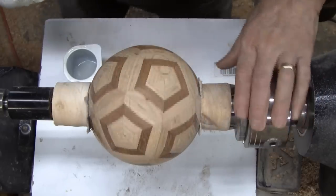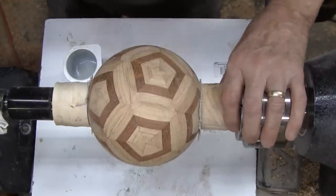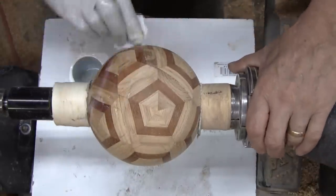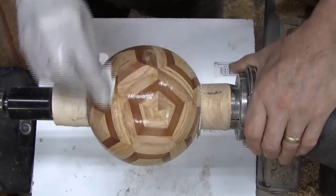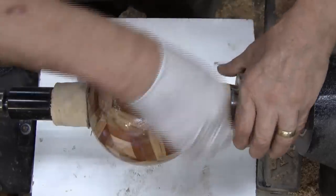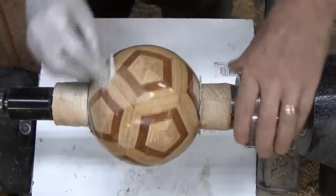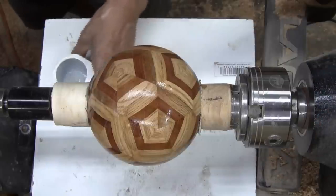All sanded to 500, and I'm going to put on some sanding sealer. I'm going to use the Minwax water-based, and then I'm going to use the polycrylic for the final finish. I'll probably get a couple coats of the sanding sealer on it, and then we'll put however many it needs of the polycrylic. So I'll see you soon.